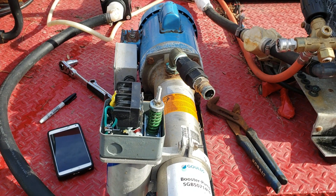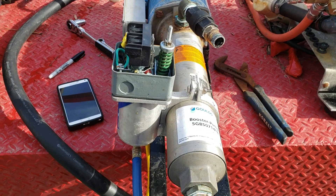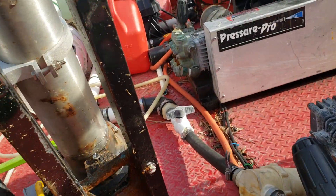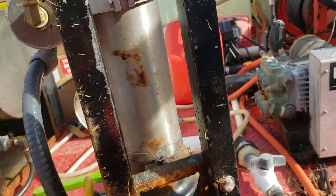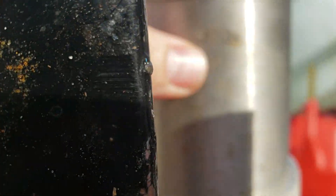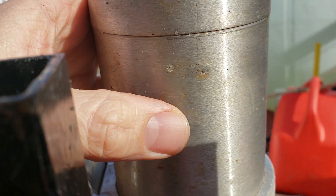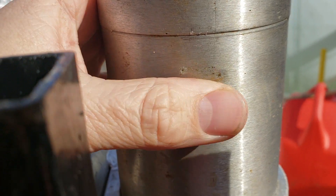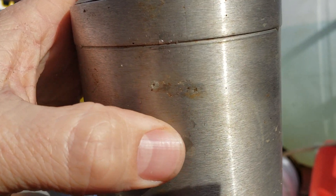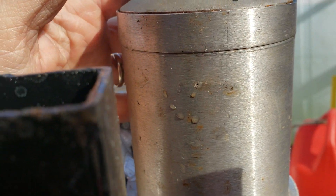Anderson Clean Power Wash — we had to take our booster pump out today. The pressure switch wasn't shutting the pressure off, which is obviously an issue, and we've gone through a bunch of troubleshooting. What we found — sorry it's not zooming in the right spot — but we literally have a pinhole right there, and actually looks like almost another one right there. Water is literally coming out of there.